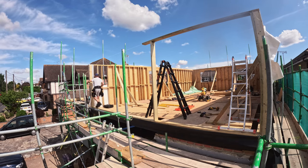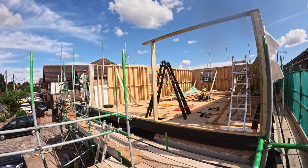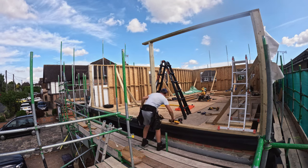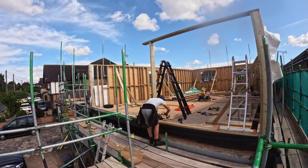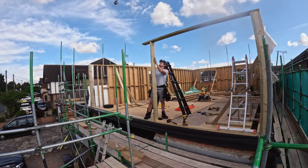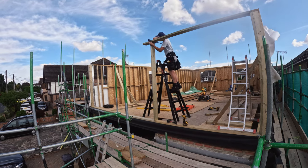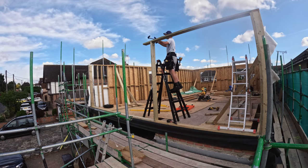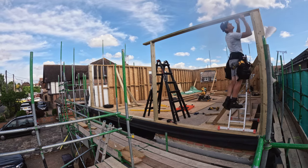This meant that I was setting all my heights basically all from that front right corner and I was leveling it with a spirit level as I went around, so it wasn't quite spot on. By the time I'd got to the front left, looking at it now, it was about an inch higher from left to right, so I put the string line in obviously so I can get that increase in wall height correct. So that's running from right to left right the way across.